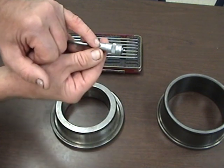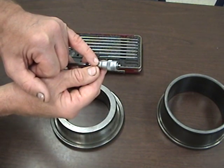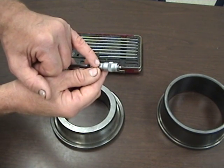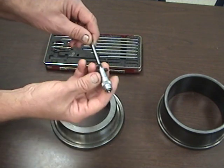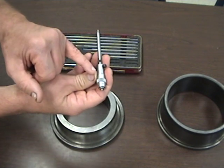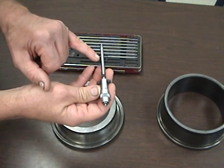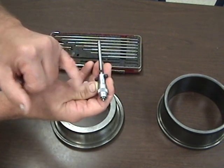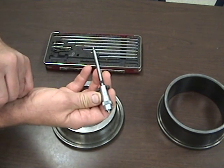There's the two, and we're at the notch right past that, which is a graduation. We're at the graduation right past the 200,000, so it's 225,000. So when we add it all together, we get four inches, 0.500, and 0.225 — so we get four inches, seven hundred and twenty-five thousandths. That's how we read that.